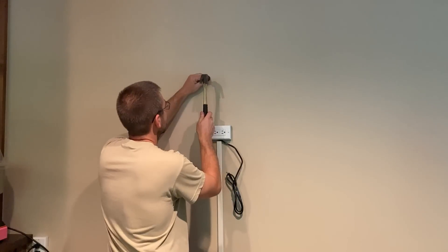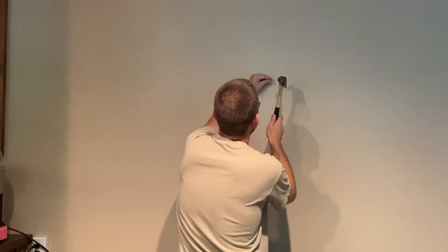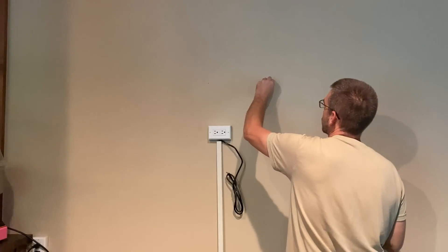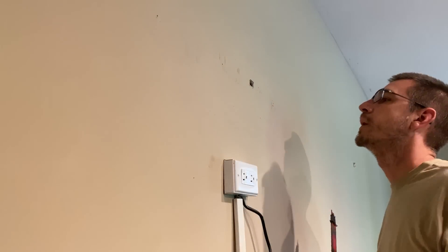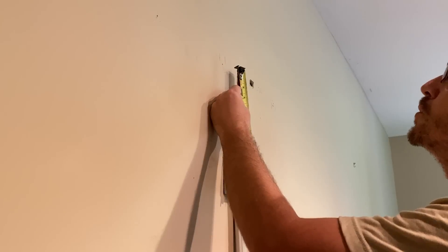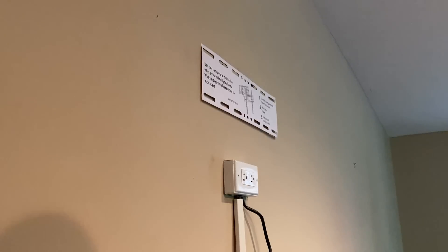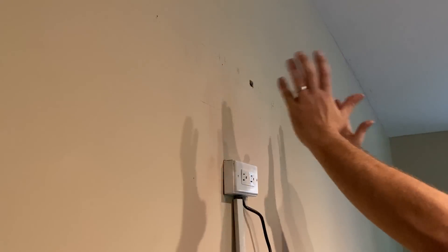Let's just take a hammer and a nail. It seems to be hitting wood over a little bit, but that one just went right through. So right here, that's concrete — that deep. That's two and a quarter inches — probably two by fours, I don't know what it is actually. It's going to be a difficult one, but we're going to have to cut out that whole square rectangle, figure out what's back here, and get some two by four braces in here so I can get my lag bolts in.